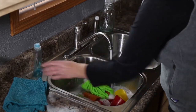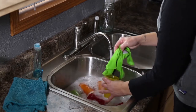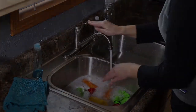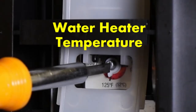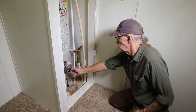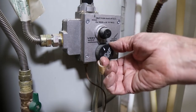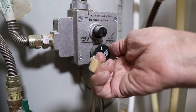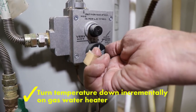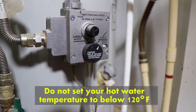If you find that the water coming from your tap when set to full hot is greater than 120 degrees Fahrenheit, you will want to turn down the temperature on your home's water heater. On this gas water heater, you'll notice that there are no numbers to help us, so we want to turn that down incrementally — step by step over the course of a day or two until we reach the desired temperature.